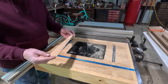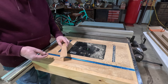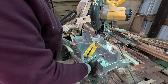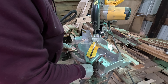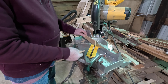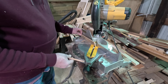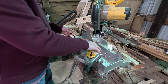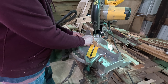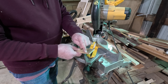The only other cutting we need to do is cut our 45-degree edge on the front. We'll go over and take care of that on the miter saw. We'll set our miter to 45 degrees — you can make it anything you want, even 30 degrees if you wanted to. Now, because we cut a taper on here, if we set this on flat it'll be a little bit out of 90 degrees. So what I do is save the piece we cut off on the bandsaw and put it underneath to get us back to where we need to be. That's not critical — a lot of these are made intentionally with a taper on the bevel — but I prefer to keep it at 90 degrees.